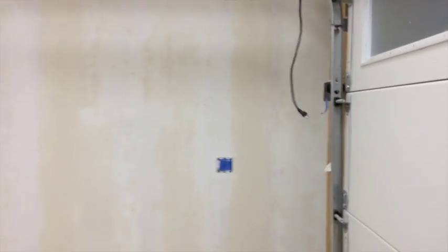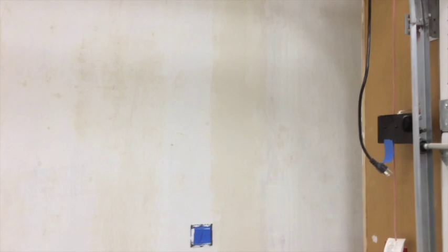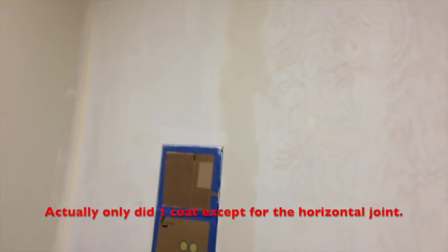You see, I got the yellow net tape covered, and put some compound on all the knot holes and screw holes and all that stuff. So anyway, yeah, did that. Remember there was a yellow tape running across there because there's about a 3.5-inch piece up there going across the top. So that's done. Well, first coat. Probably need at least one more. But there's some more progress.